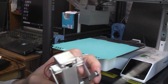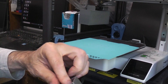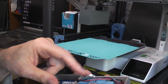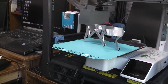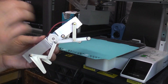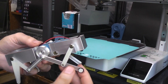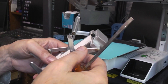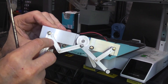Theoretically we've got it all wired up. If it walks backwards when you power it up, you can either flip the two wires around on the motor, or undo the cams and motor bolts, flip the whole motor over, and put it back in. Something's a little tight, so we need to find out which screw is too snug. I'll loosen these cam screws just in case, and loosen anything that feels a little snug.